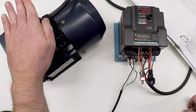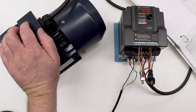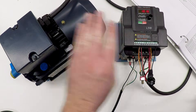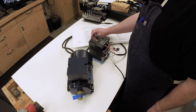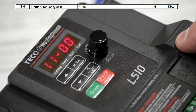The other thing you can hear is this thing whistling — that's because the carrier frequency is set to probably 5 kilohertz from the factory, which is what the manual says. Let's check what's actually set. The carrier frequency is setting 1101, and I need to set it somewhere between 1 and 16 kilohertz. I'm going to set it as high as possible so I can't hear it. Press Mode once to get into setting mode; you're now looking at setting number 1100, and I want 1101.